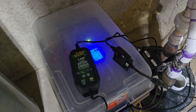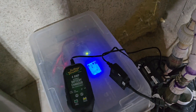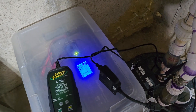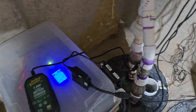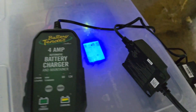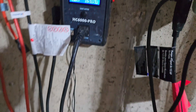The reality is that in the 12 years I've lived in this house, I've had the power go out maybe an average of once a year, and I've yet to ever lose power during a rainstorm. So I'm probably not going to use this a lot, but obviously I want it there in case I need it. I don't want my battery sitting at 100% for years, so I only top it off when there's rain in the forecast and there's a chance I might need it. Inside the enclosure there's just a battery, inverter, the HydroCheck backup controller, and the main pump.